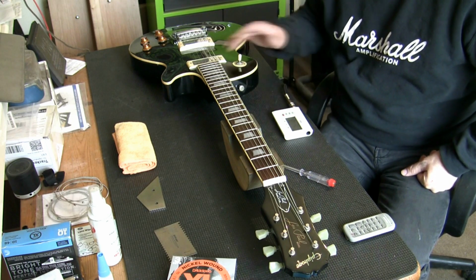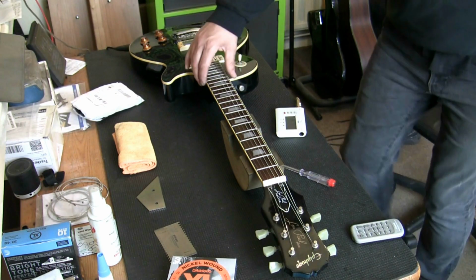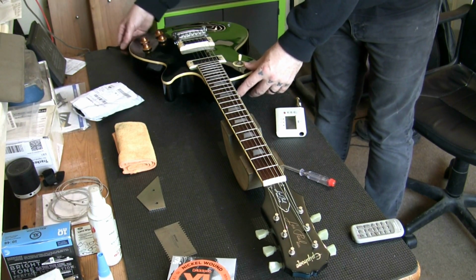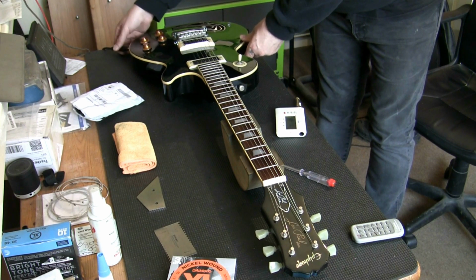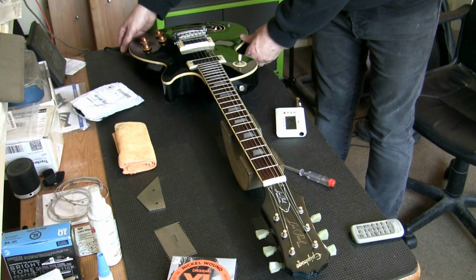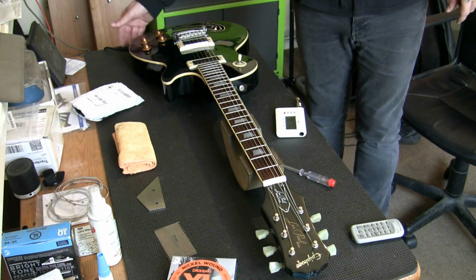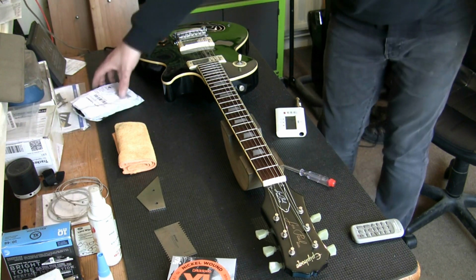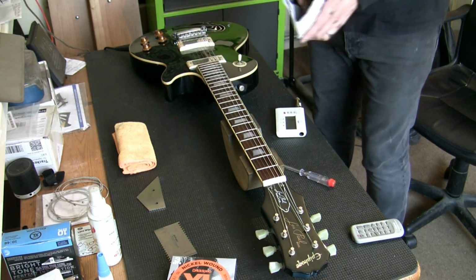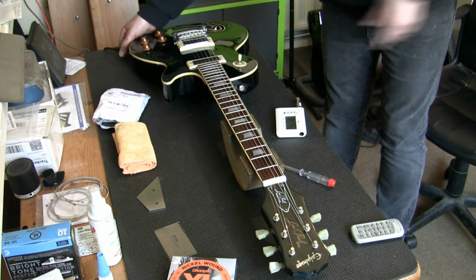it will be playable, and I'm going to test the electrics, and we're going to check this input jack. Regarding the jack, seems fine to me. Bit of a scratch there. Okay, yeah, it's cutting out a little bit, so I will get in there and we'll have a look. I'll clean it up, reflow the solder. If need be, I have some brand new replacements, we'll stick a new one in there. Maybe it just needs turning around a different way.